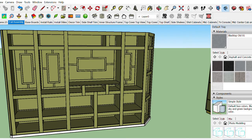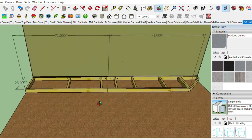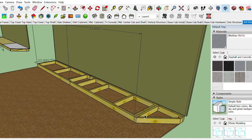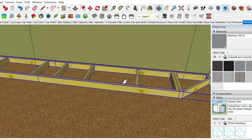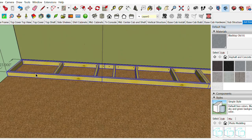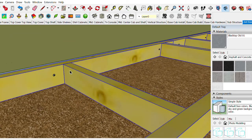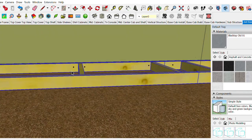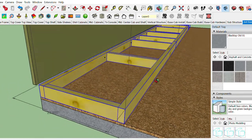We'll jump to the back because this is the very beginning — we're going to talk about foundation. This is the 2x4 structure I started off with, in three sections: the little end section where I have the shelving, and two other sections. The two sections are just the distance from here and there divided by two. I pocket-holed my 2x4s, though you could simply nail them or do a countersunk screw.